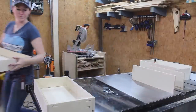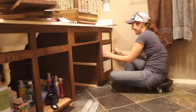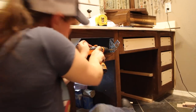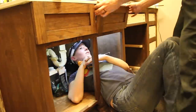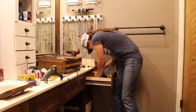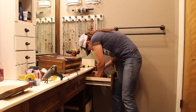And we are in the home stretch. Instead of buying new sliders I'm reusing the ones from the old drawers. Instead of making these two faux faces again I bought some hardware to make them tip-out drawers. Installing these is definitely a two-person job, and it certainly helps having a helping hand getting up from under the sink. For the drawer faces I clamped it in place and then just screwed it in from the inside using two screws.